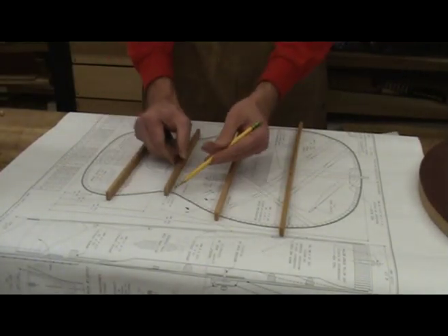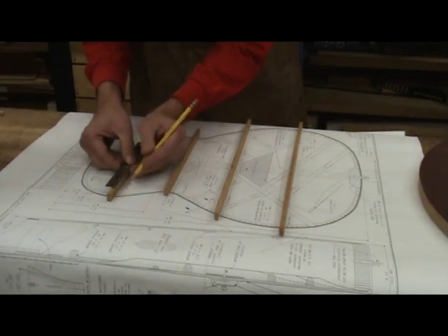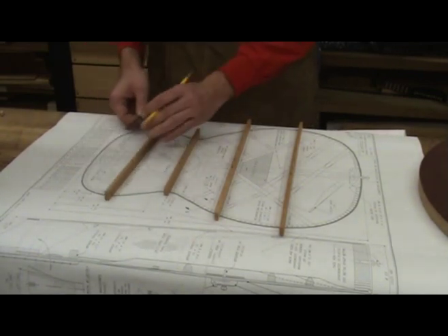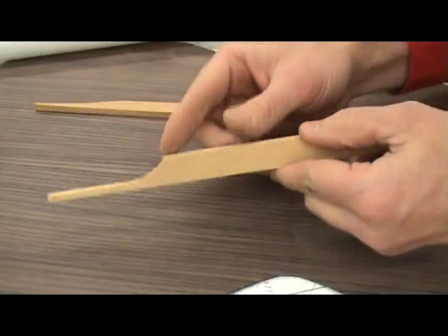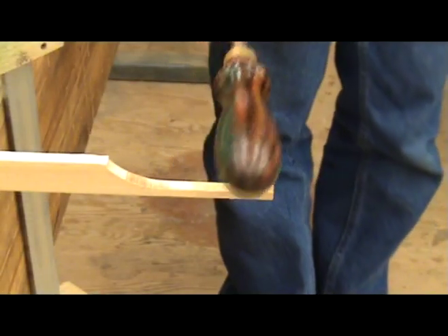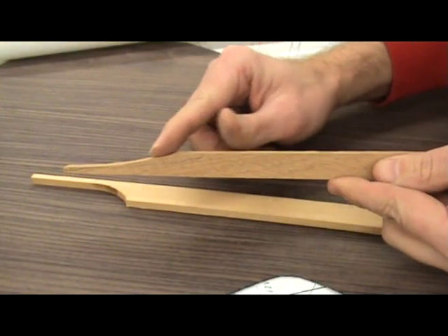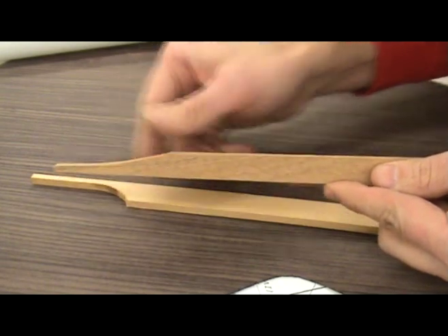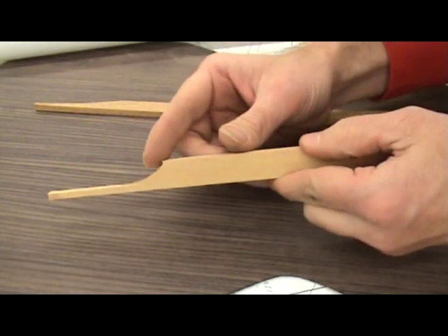My braces are cut to length so that they are hanging over the perimeter of my guitar by about a quarter inch, or around 6.5mm. I like to pre-scallop the edges, coming in from the edges about 60mm or about 2 and 3/8 inches. There are two types of scallops: one is a drastic radius, which in my opinion creates a weak brace due to the large amount of end grain exposed. The other is almost a parabolic shape — this gradual contour makes for a much stronger brace and is less vulnerable to movement due to humidity changes.